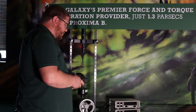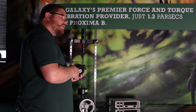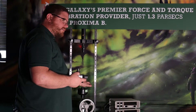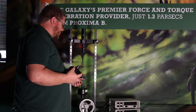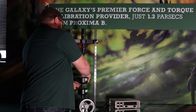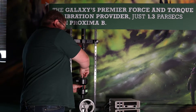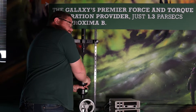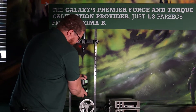In this case, these two load cells are the same, so they will thread directly together. We sell tension adapters of various sizes on both ends to go between your standard load cell and the unit under test. If they don't have matching threads, we have adapters to go between them. In this case, they're both Morehouse Ultra Precision Load Cells with the same threads, so you just thread the unit under test directly on top of the reference standard. Don't jam them together — make sure there's a little bit of play between the two so they don't lock up.